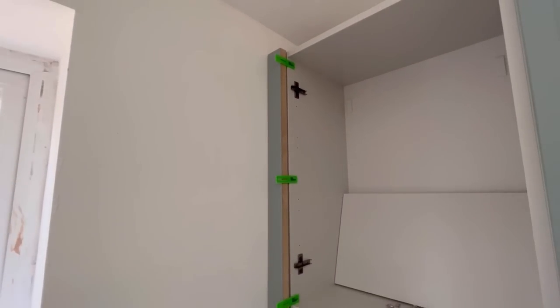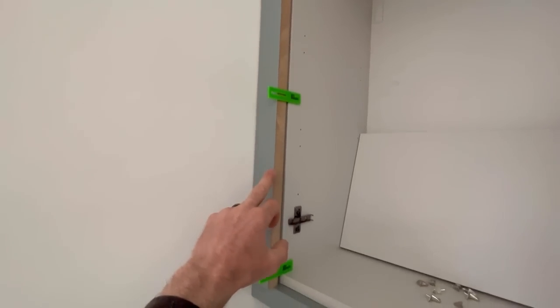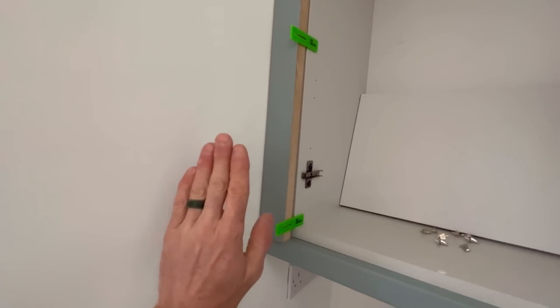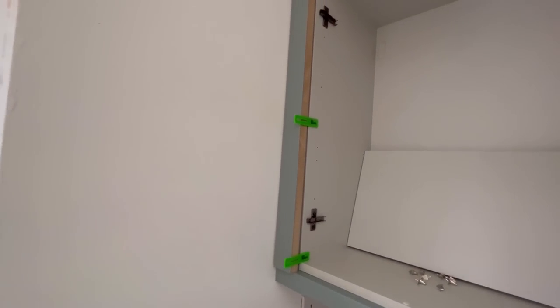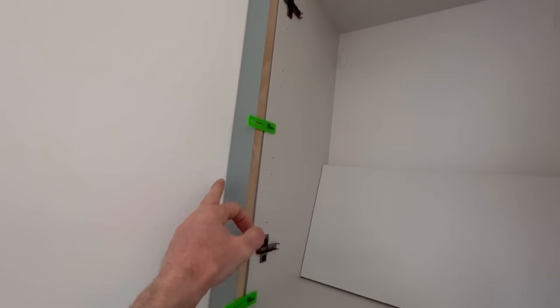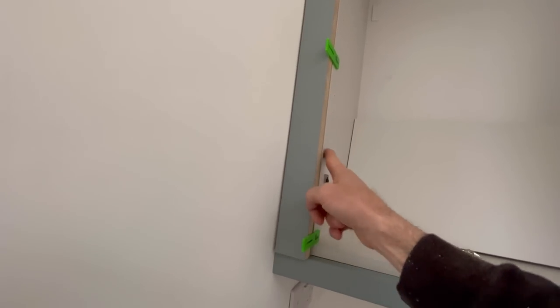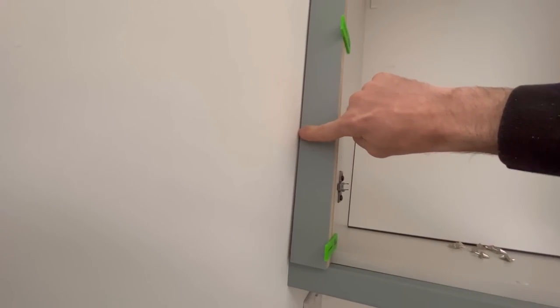This interests you. You scribe, that's what these are. If you're scribing for these decor panels between the wall and the cupboard, first step, get a piece of stock. I'm going all American now, aren't I? Piece of stock, that's all that's about. So you measure from the wall to the cupboard there, and then I cut a piece a blade thickness smaller, like that.